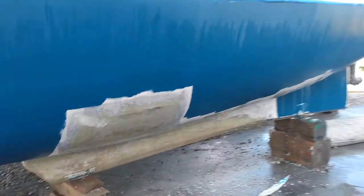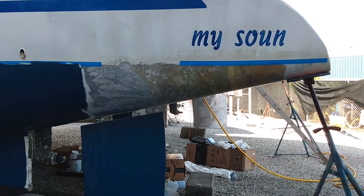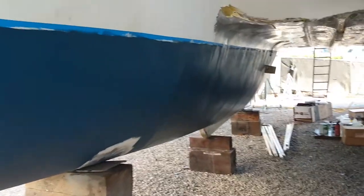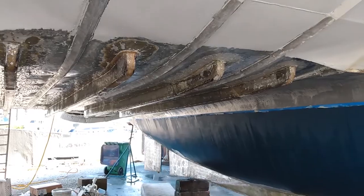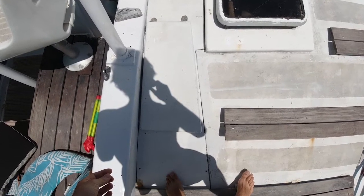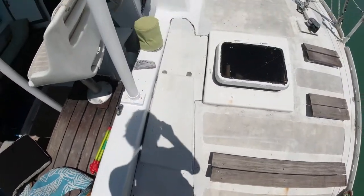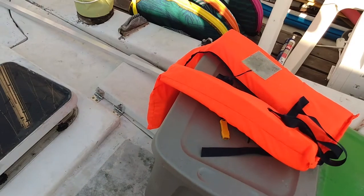There have been some additions. We have the keels being extended, and the sugar scoops being extended, which we really like. Underneath the boat, we have the ridges on the bottom so that when you get wave slap, it doesn't vibrate the entire bottom as much. And these big ones are fiberglass added to it. Between the hull and the back cockpit was nothing originally, and they added fiberglass so that it's continuous from the hull to the cockpit area. And now there's a storage place. We had a bit of rain, so we're letting the life jackets dry out that were in this green container.